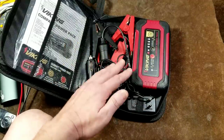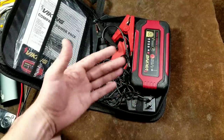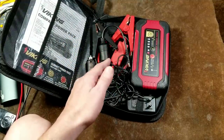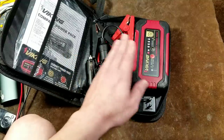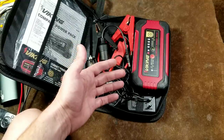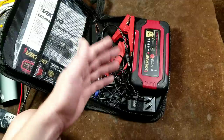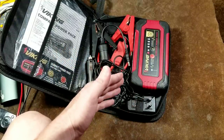They tell you to leave it on the battery for a few minutes — that's because the lead-acid can deliver more energy in a shorter period than a lithium-ion. Attach this and leave it plugged in for a few minutes to actually recharge the lead-acid battery, then combine the two to get the engine to kick over. Make sure the doors are shut and the keys are out of the ignition so you're not wasting power driving light bulbs and other loads.